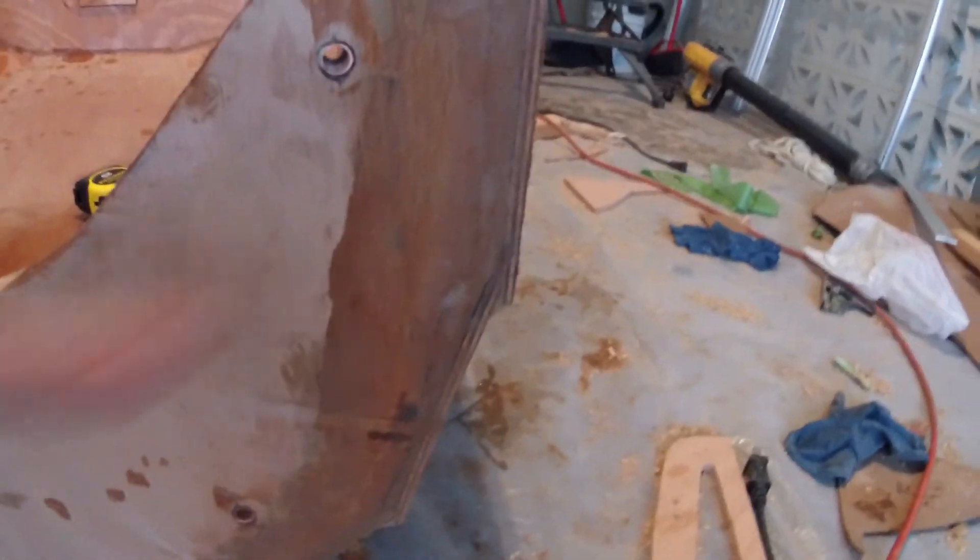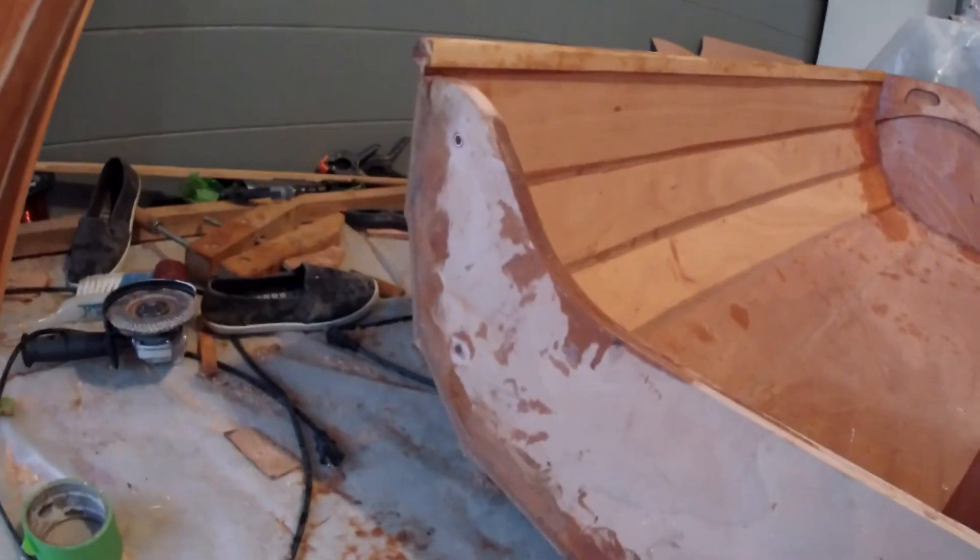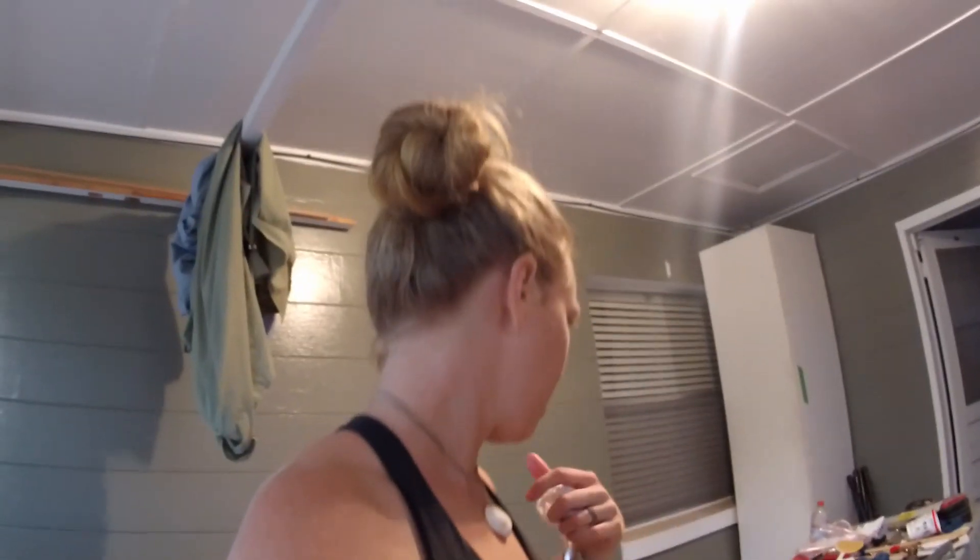After we cut the boat in half, there were gaps here along the edges. All those have been filled and rubbed with alcohol now that they've dried a bit. We got a nice solid bulkhead. This is the aft and this is the forward. We cut in a little bit wrong here, so I've had to build this up a little bit with the thickened epoxy to make that fit. All our holes are still open. It's looking good, and since I had extra epoxy I did all the fillets here. It really looks like a boat.